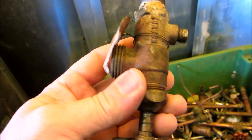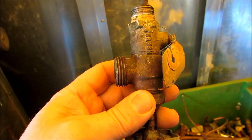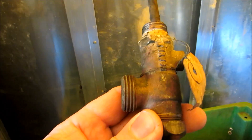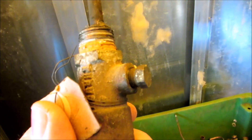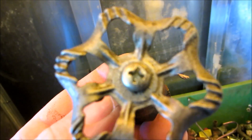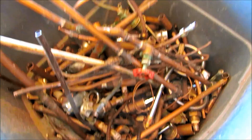Here's another one of those drains for the expansion tanks. You put a hose on this, shut off the ball valve or globe valve to the expansion tank, put a hose on this, and take this little plug out — it'll let air in to the top of the tank so you can drain the water out. Some of the other ones have a screw on the end that you take off and it lets air right up a tube. There are a couple of different styles.